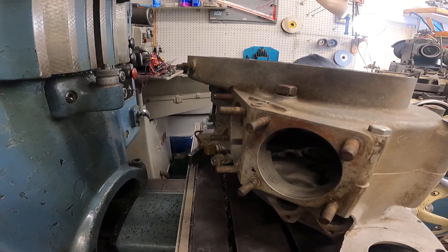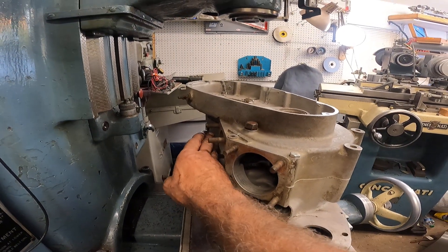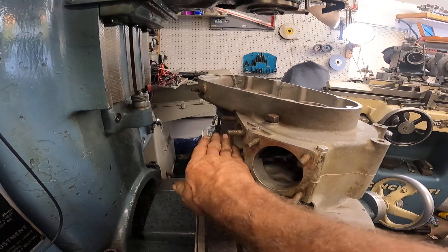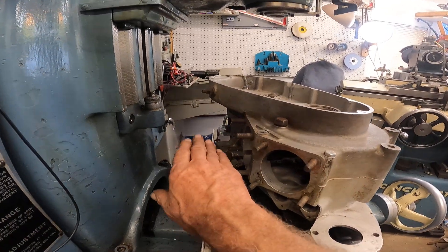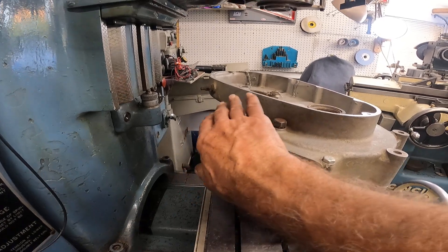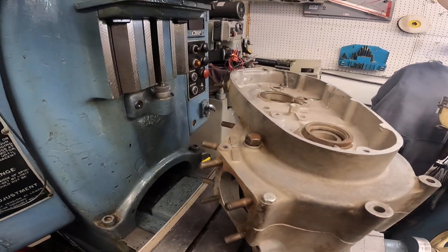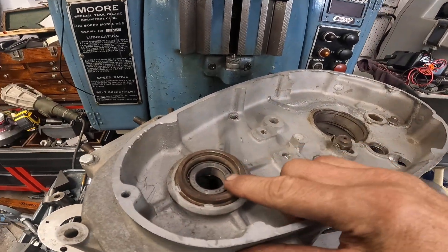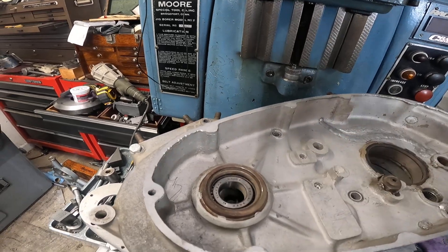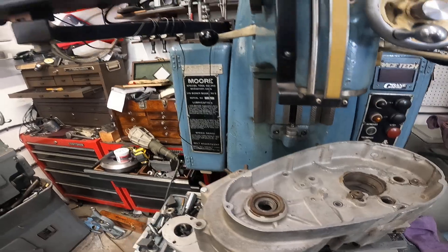If you are a Harley Davidson enthusiast and want to work on these cases, here's a very important point: at the factory, the engine cases are machined and fixtured going off the rear cylinder plane. This is what you'll line up with your X-axis — the rear cylinder. The reason they do that is it's the most stable, most solid metal there. That's just directional alignment. Then all other dimensions will be based off the center of the crankshaft — everything mapped out at an angle like that. If you need to do something to the other side, you mirror-image it, flip it over using your digital readout.